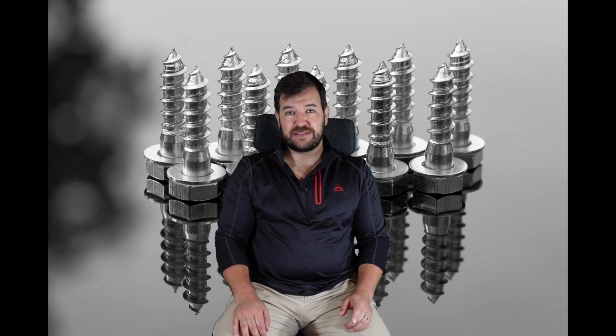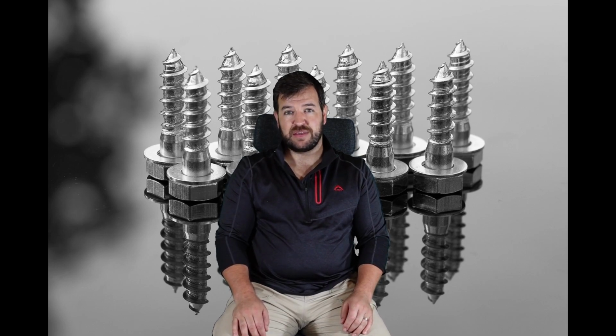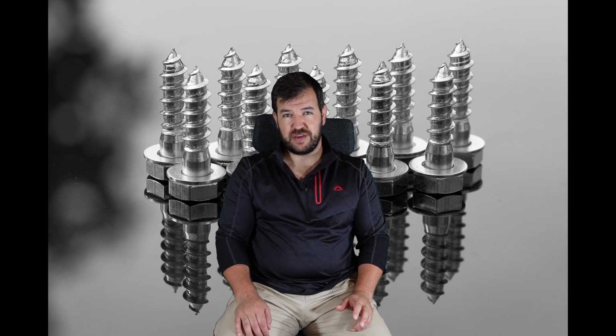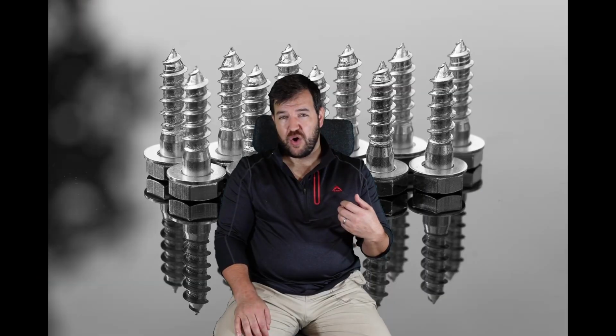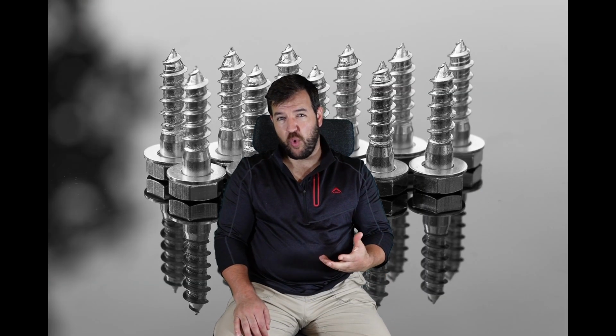Today we will be looking at carbon fiber machining. Yes, carbon fiber is a very machinable product, can be machined into very useful shapes. There are quite a few precautions that you have to take that are very necessary for your health and your safety. When machining carbon fiber, it is not something that you want to inhale or get into your lungs or really touch in its powder form. We're going to look at the different precautions that we take when we machine the product.